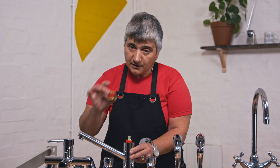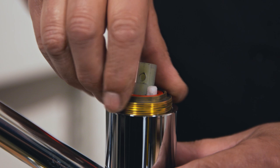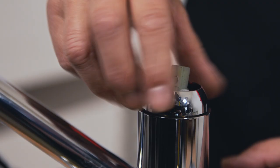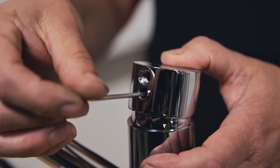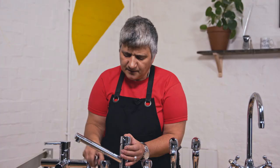Put it in — you'll know it's located correctly because it won't turn. Then get your retaining nut. If you're finding it difficult to locate the threads, just turn it backwards until you hear a little click, then turn it forwards clockwise to tighten. Hand tighten first. Once you've hand tightened it, get your spanner clockwise until it stops — don't go too mad with it. Then your decorative shroud goes back on. Then the head will go back on. Get your two millimetre allen key, locate it into the screw before you put the head on, then put it on and tighten up the allen key. Just until it doesn't come off. Put your cap back in and screw the handle back on.